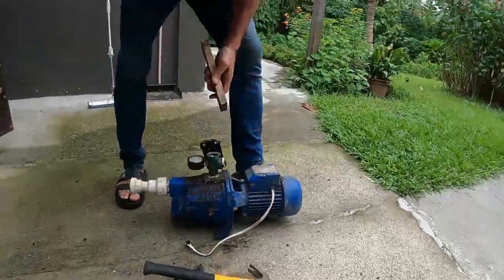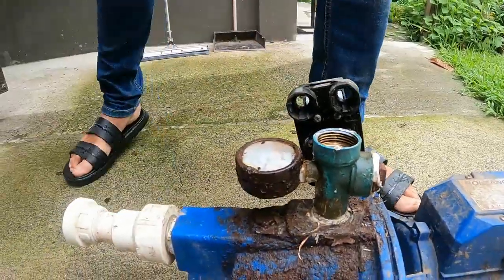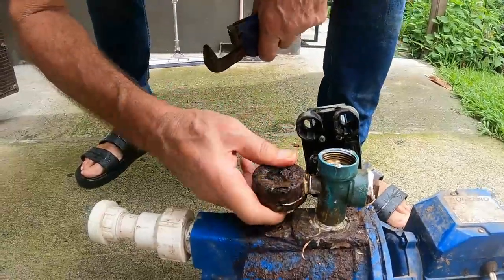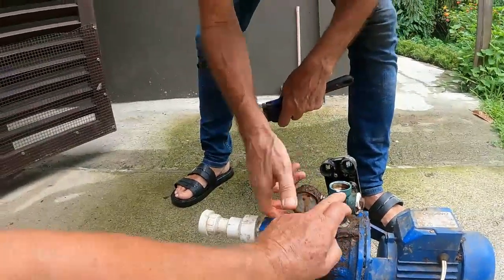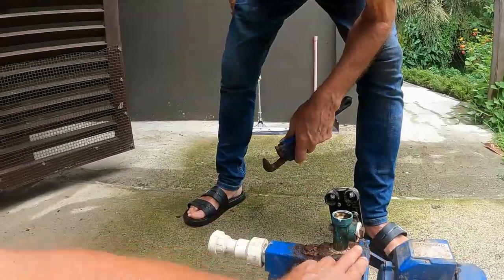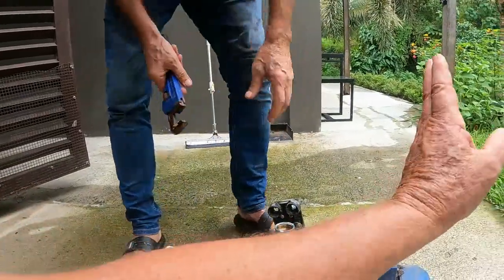She's pretty ugly. The way this system works is that it comes from your pump through here and up to here. This goes into your household and this one goes into your tank. So when it pumps up and gets to 40 PSI it will shut off.